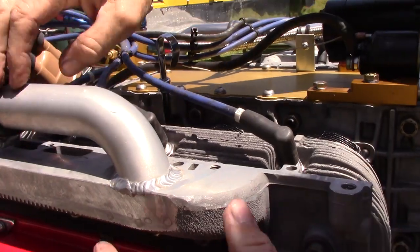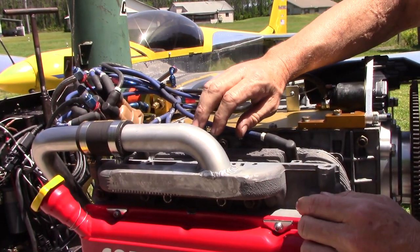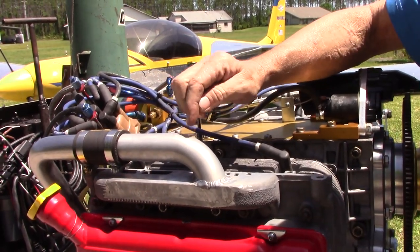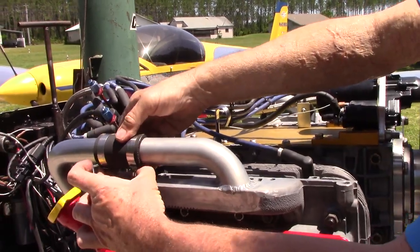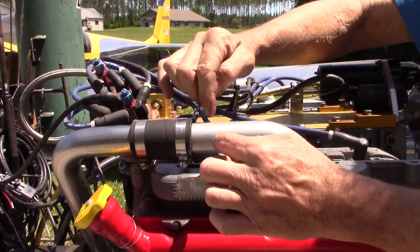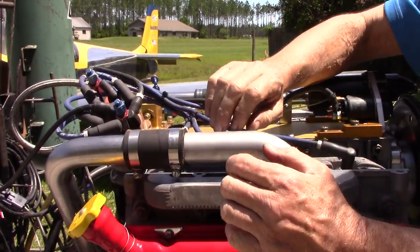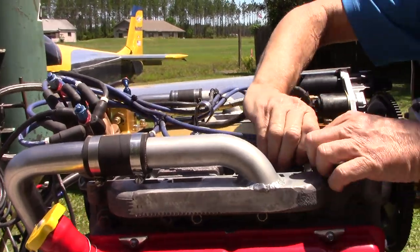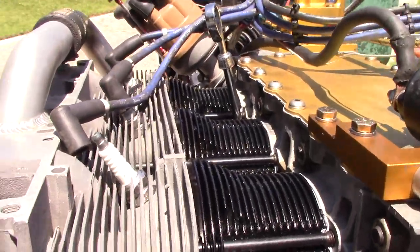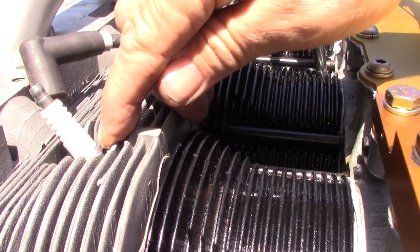These are welded-on aluminum tubes — a pattern developed 15 years ago that all the engines have had. The configuration is held in place with a hose clamp where it transitions from the stainless steel super thin-wall intake manifold to the aluminum head pipe. The system works. Now let's check the plug: that's an iridium, and the number on it is 24. The iridium 24 is appropriate for a 3-liter. As the number gets bigger, the cooler the plug.